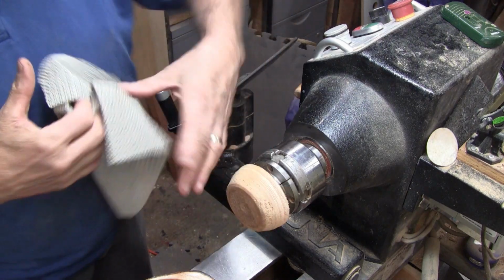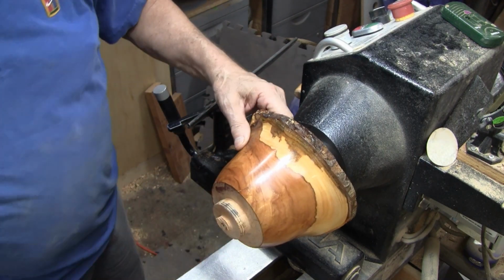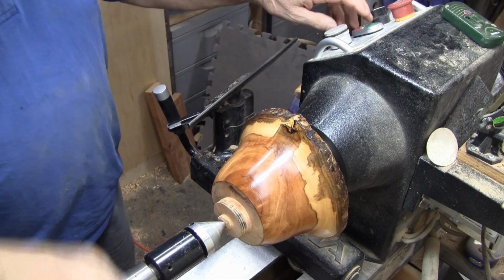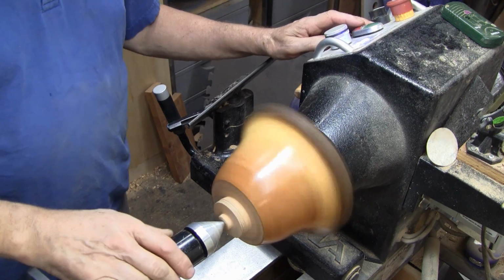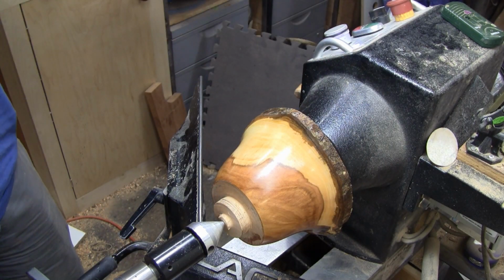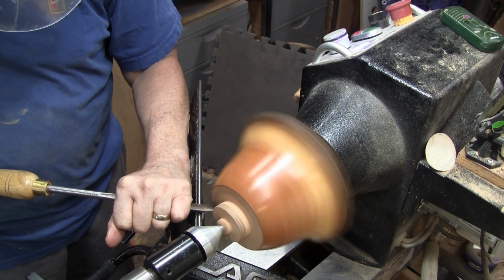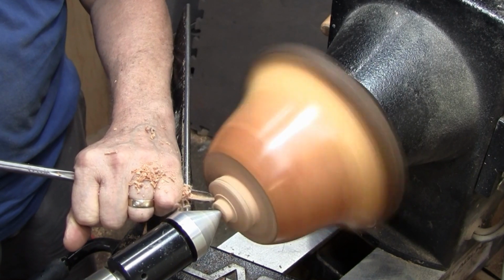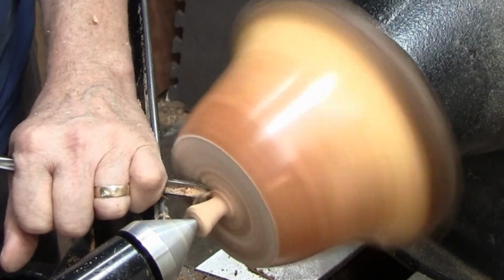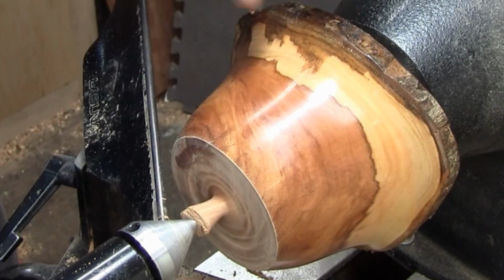Okay, I've got one of my little blocks mounted in the chuck. Put some non-slip padded material in there. Bring up the tailstock, use the center that I started with. A little pressure on it. See how it spins. It actually looks pretty good. Get my face shield. Start cutting this off. I like to examine this, make sure it's still plenty strong.